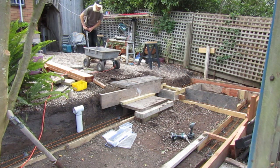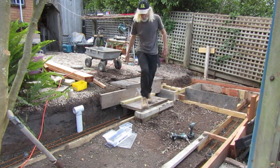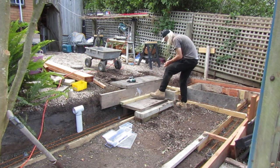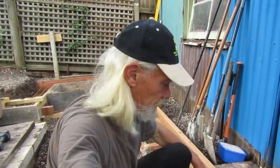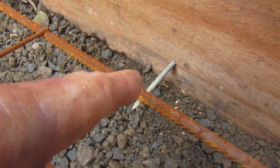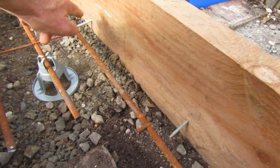After testing out our step and being satisfied everything's at the right height, we lock it in with some screws. One more thing we're going to do before we pour concrete is put screws in through this treated timber because it's going to stay in place. This will help lock this treated timber into the concrete by putting screws periodically all the way along. This is going to help make this really solid to the concrete.